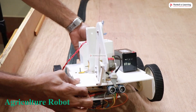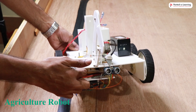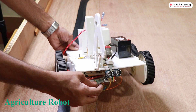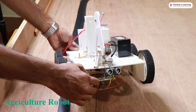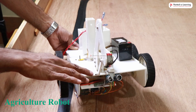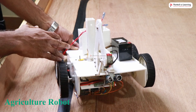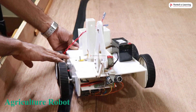Inside here we have an Arduino Uno motor driver board and an HC-05 Bluetooth module. We have two options in the robot: either we can put it into manual mode and control it using commands. Every single function has a command character — for example, for moving forward you send the character 'f' and it will move forward. Similarly, every single function has a command character.